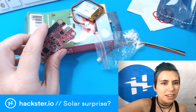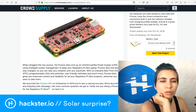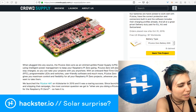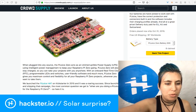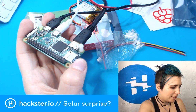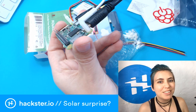You mount it on top of the Pi Zero and it's very low profile because of that! You don't need an entire female header on the bottom — it's just shrunk on the top. My Pi has a couple of foibles — I soldered the headers on at a bit of an unfortunate angle, so it could be difficult to get it mounted all the way properly, but for other Pis where you soldered the headers on properly you shouldn't have that issue.